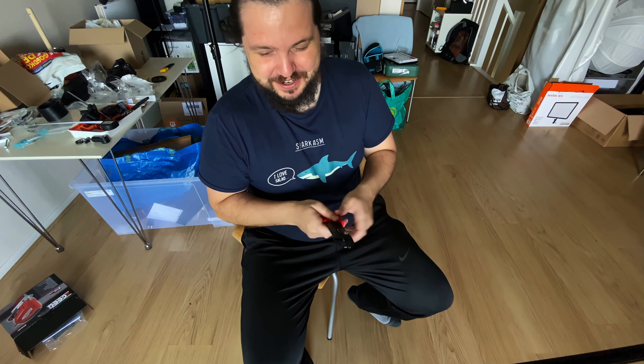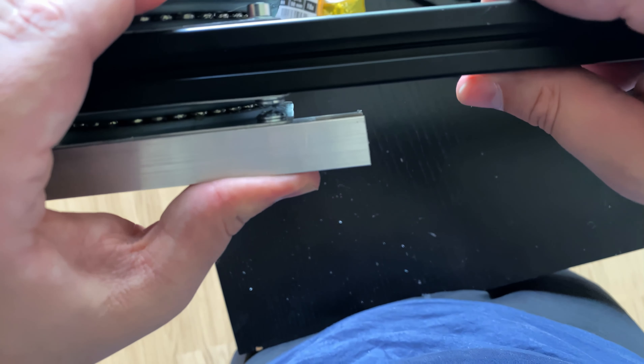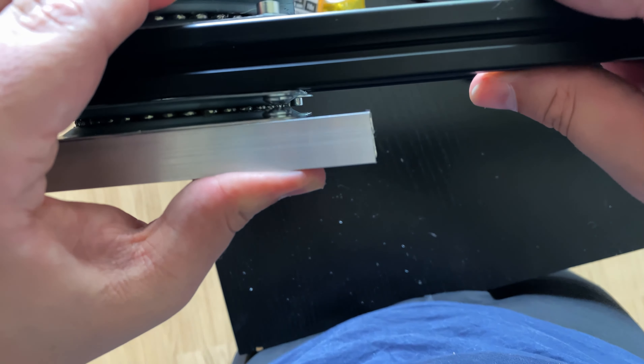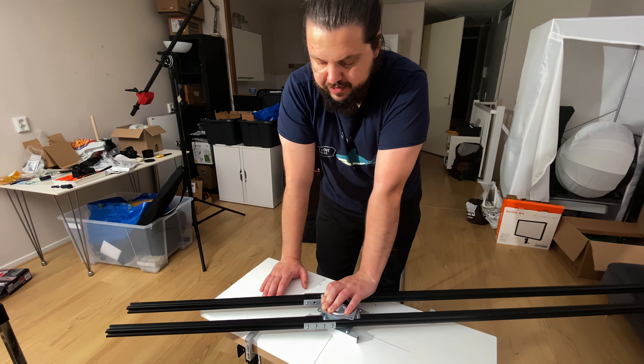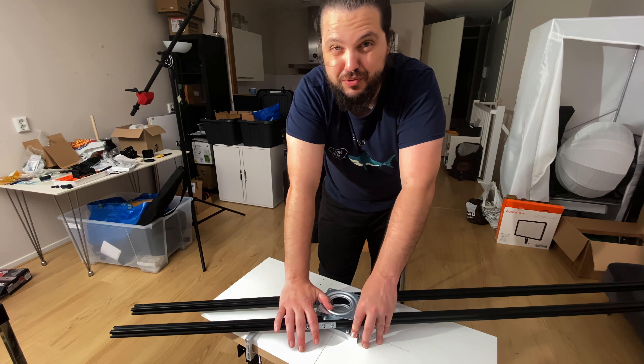There's a little bit of space here that I'm trying to fix by cutting the screws. The solution I found online: I have this clamp with sizes M3.5, M4, M5, M3. By just putting the screw of the right size in it and then choosing the right slot, by closing it you're gonna cut the screw very easily. I'm gonna make you a demonstration of how to cut the screw — moment of truth.